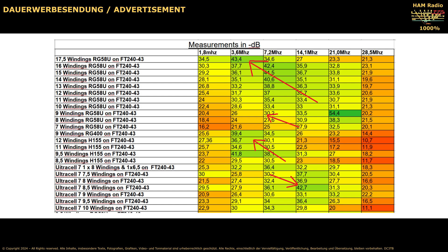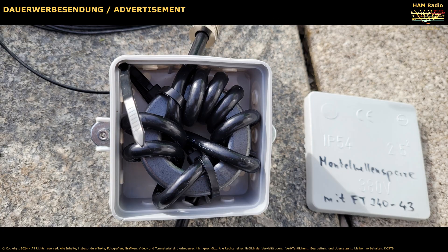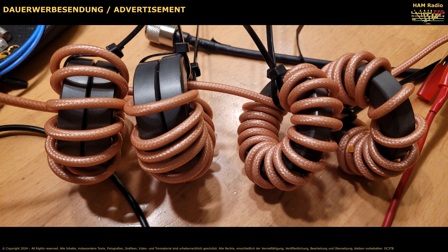In general, if you try more windings, the choke should get better. But that is not true. I made different tests with RG58, RG400, H155, Ultracell 7, and then I have tried to connect them together or use more than one core.